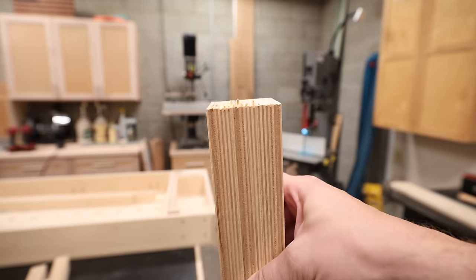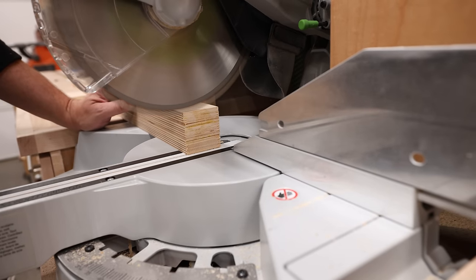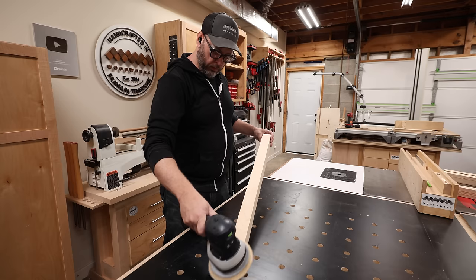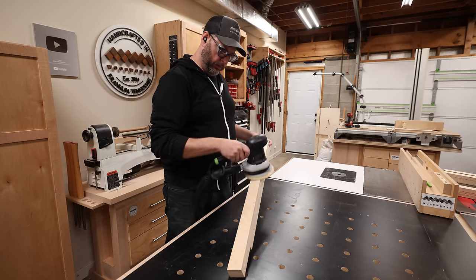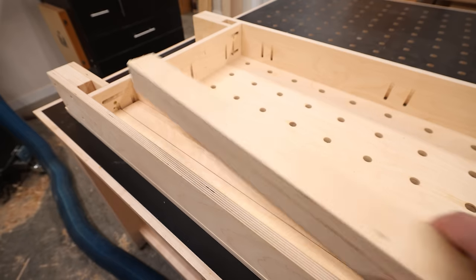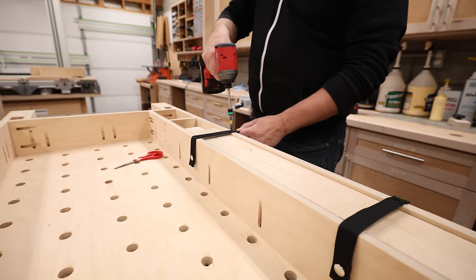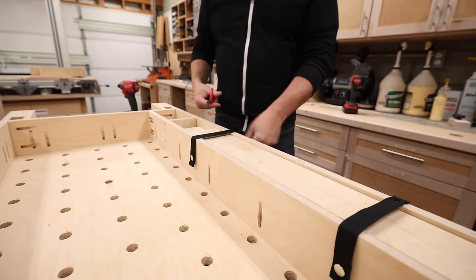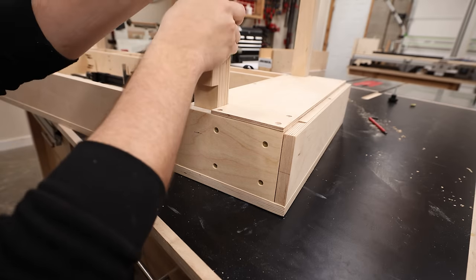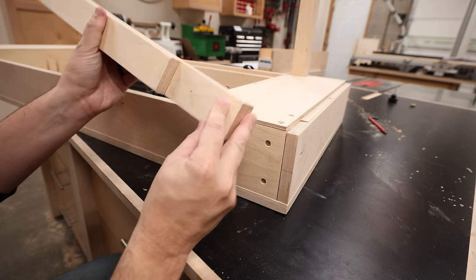That's okay because I made these legs extra long so that I could cut them down to final length at the miter saw. You could use a table saw for this if you don't have a planer or if the plywood that you're using isn't solid wood throughout. I also made sure to sand these legs smooth one more time just to make sure that all the corners are rounded over and everything slides in and out of the workbench nice and easy. To store the legs, I created this little pocket on the underside of the bench, and then to hold all the legs in place, I'm just going to use some snap straps. And then to secure the legs while they're in use, I'm going to slide the leg into the pocket that I created with that blocking. From the outside, I'm going to drill a small pilot hole through the apron and into the legs — this will perfectly locate where to drill a larger hole that's going to accommodate a threaded insert.